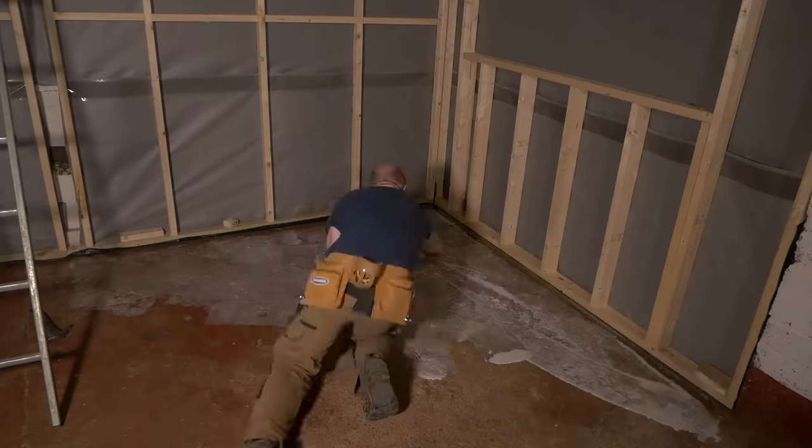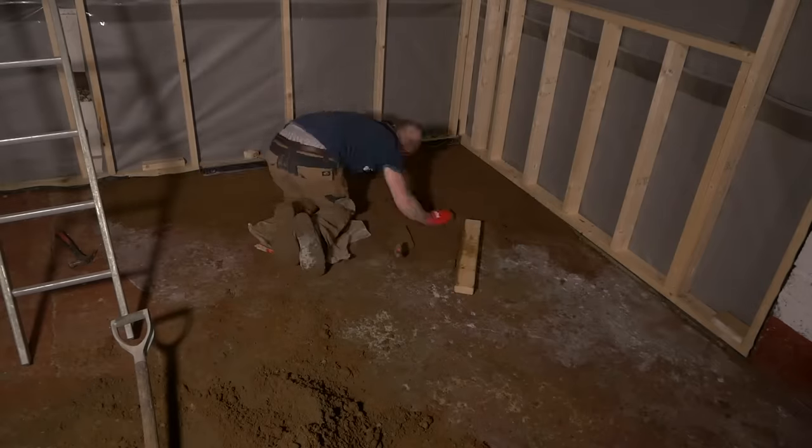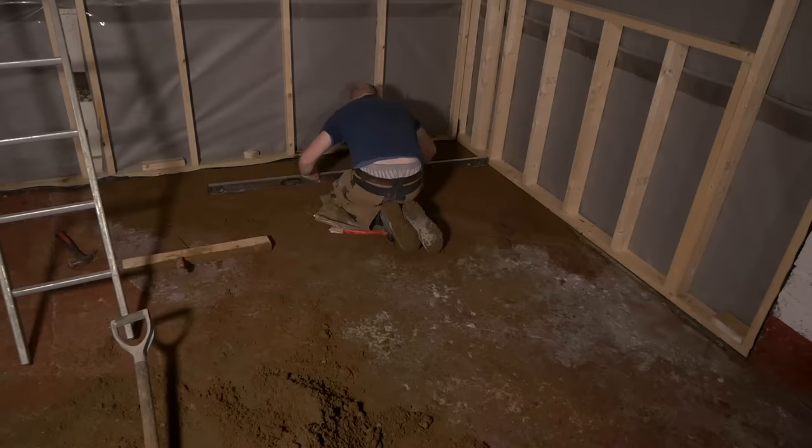Right - that was spanned over three or four days, so sorry if the video is a bit choppy - even changed the camera halfway through. So now I'm going to crack on tonight and pull a late one - I'm going to try and get this floor levelled out. I think I'll just knock up a bit of sand and cement screed to bulk up the corner because there's a good 40mm there, and then I've got some self-levelling compound if I need it to fill the other voids. I didn't really want to start buying £100 worth of self-levelling compound if I could help it - it's all going to be underneath the DPM before the insulation anyway. The only reason for levelling it is I don't want the insulation boards to rock at all, and you need a fairly well blinded or screeded floor to do that. Thanks for watching - if you haven't subscribed, click down below, click the bell symbol and you'll get notifications when the next videos are up. Remember, if you can do it yourself - we'll see you next time.